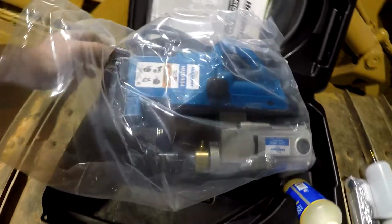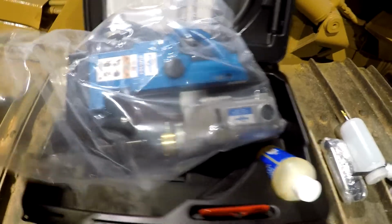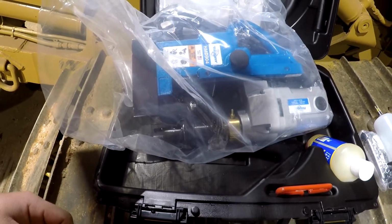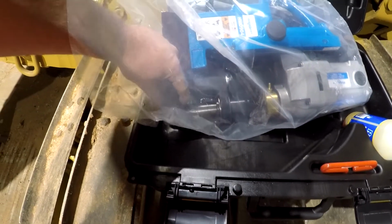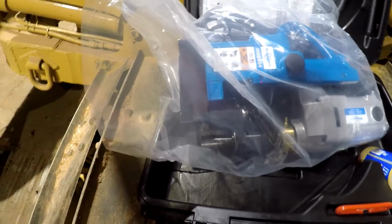Drill holes all the way up from stuff you drill with a small drill, with having this chuck here, all the way up to, like I say, 1.5 inches is what it's rated for. The cutters I got right here ordered, as I say, up to 1 1/16. And I figured that would be the most that I would usually use something like this for. It's also a 2 inch depth of cut, so it'll drill through 2 inches deep.